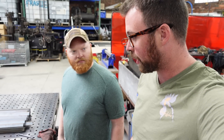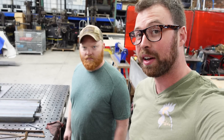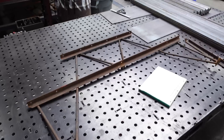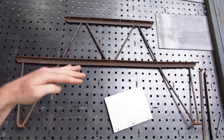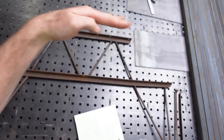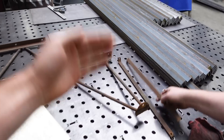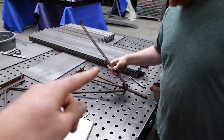It all started by getting a contract from a local Boy Scout camp to make or recreate 35 picnic table bases. This is one half of a picnic table frame — the bench boards and tabletop all sit on it. It's all half-inch round bar, inch and a quarter angle, eighth inch thick, with some flat bar pieces that give it diagonal structure to tie into the top and underside of the benches.